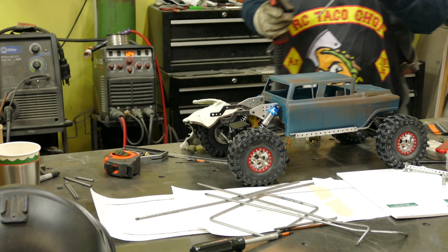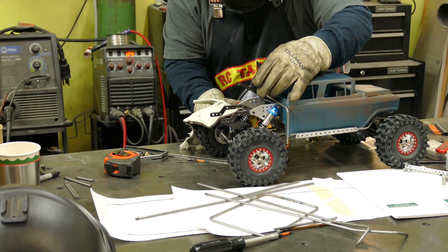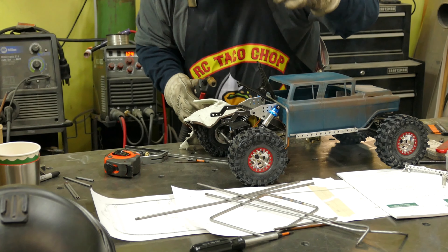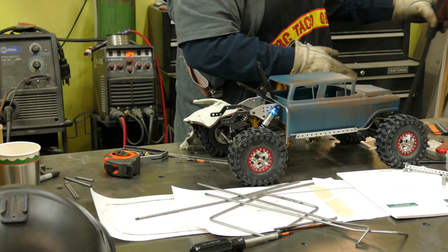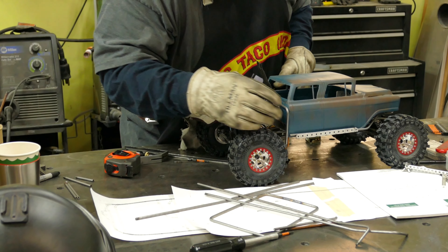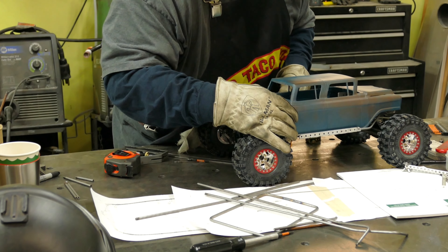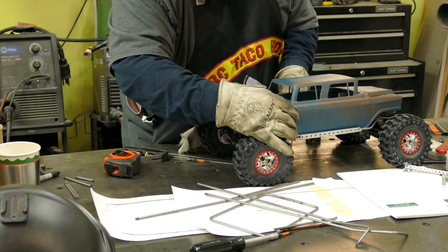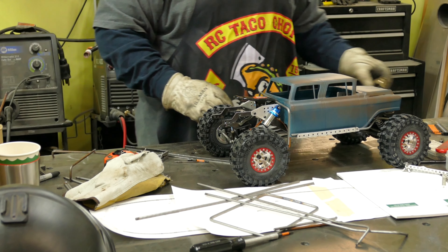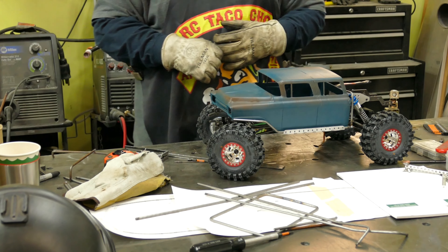On the other side I have the bottom rail that follows the fender locked in place, and now I'm just tacking the main hoop to that. A little trick: if you just tack the edge or the corner, the metal is still soft enough where you can bring it up to where you need it — you can bend the weld and the tubing to get the position you need. Right now I'm bending it up to see where I'm at, but that rail isn't quite in the right spot, so I'm going to flip the truck and jig things up.